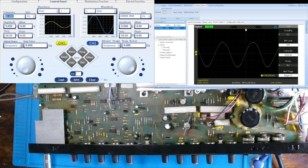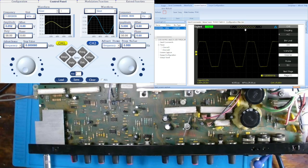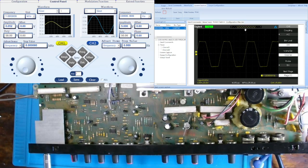See, it didn't change anything on my O-scope. That is my bad. I made the change for the frequency on the SIGGEN itself. I didn't make the change through the software, so please keep in mind that instead of 1,000 hertz here, it was actually at 80. So I will actually make the change through here now, 1K Hertz, and you can see that corresponding change on the O-scope and the SIGGEN. Now we are at 1K Hertz.